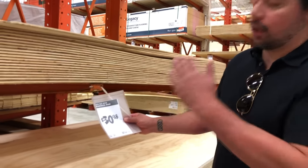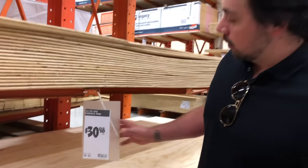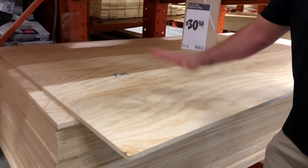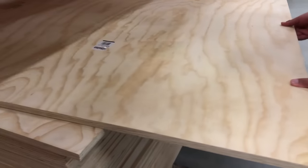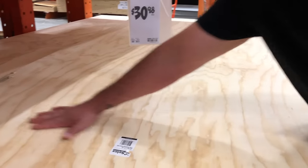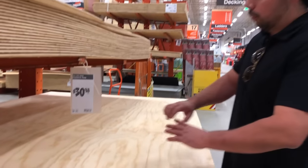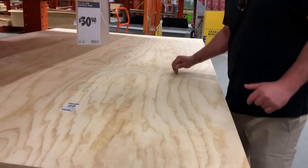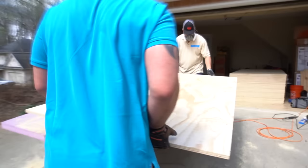This is the style of plywood we chose — Radiata pine, also called cabinet plywood. This is typically used when building higher-end cabinets. As you can see, it is not as yellow and it is smooth — it's pre-sanded already. Even though after you rip it you'd still want to do a light sanding, there are no burrs on it so you can run your hand over it smoothly.